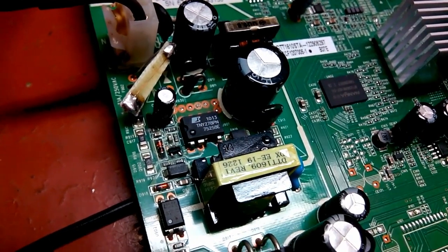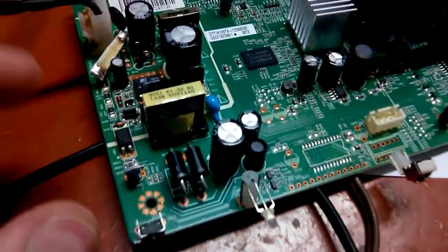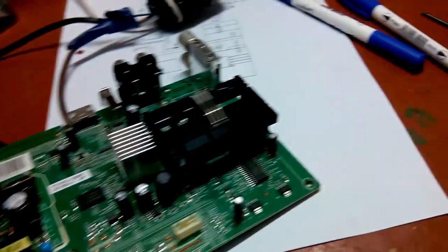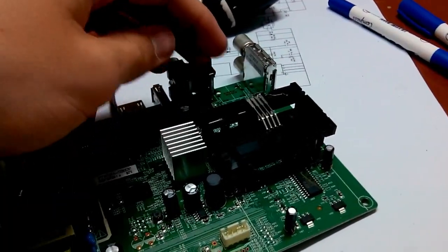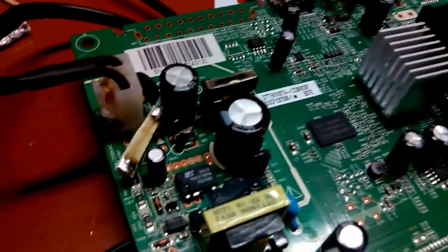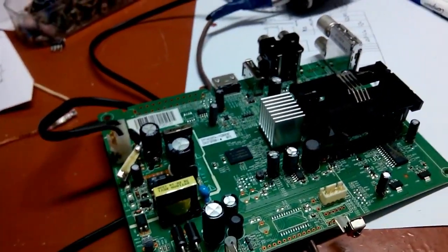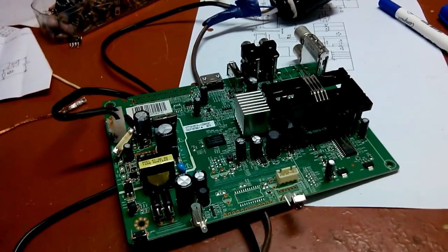The diode was in a DO-35 package, kind of like a 1N4148. I tested a few other components - all seem good. I plugged it in with a 15 watt ballast, seemed all right, then upgraded to a 40 watt ballast, also all right. Then I plugged it straight in, connected to an antenna and a TV set, and it works! So great - low parts count, three parts replaced, and it's back to life. Anyway, thanks for watching, see ya.